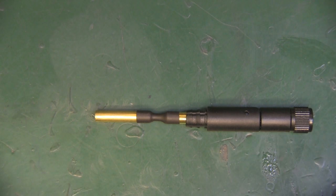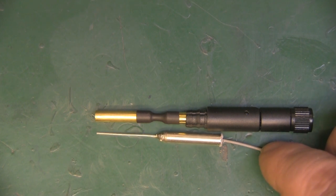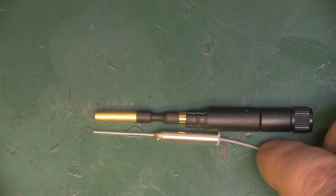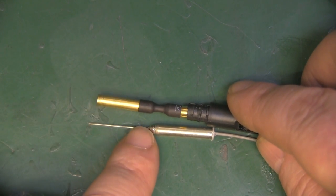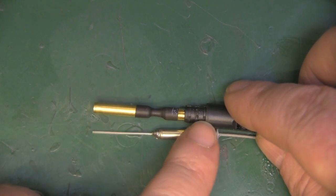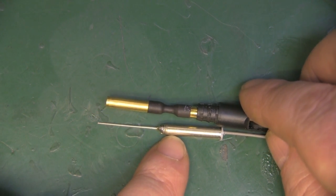Now that we can see the inside of the antenna, we can see it's a little bit different to what we normally see. If I bring in a 2.4GHz dipole antenna and put it at the side, you can see it's very different — there's a piece of tubing at the top and at the bottom. The measurements are also a little bit different; this piece of the antenna is a little bit shorter than the 25 millimeters. At the base it's exactly the same, because these hertzian dipoles need to be matched at a quarter wavelength, a quarter wavelength.